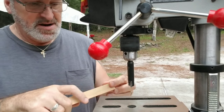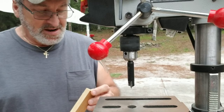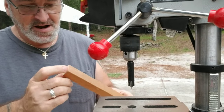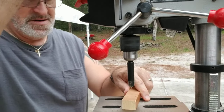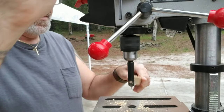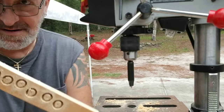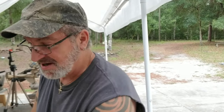What's fun about this is you can grab any kind of scrap piece of hardwood you have — or any type of wood you want to use — to cut plugs. Since I'm putting this in a walnut fretboard which is dark, I got this piece of hardwood here — it's off of an old tabletop, I think it's birch. So I'm going to cut some plugs. I'm going to have to hurry because it's starting to sprinkle out here. There's one — I need seven. There's eight, one for good measure. This birch wood makes really nice fret dot markers.